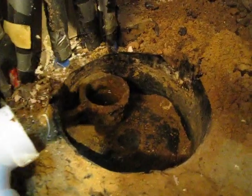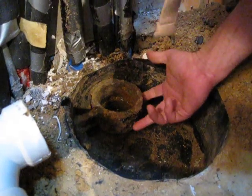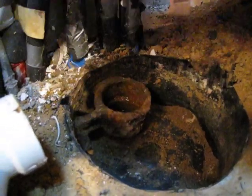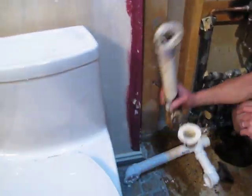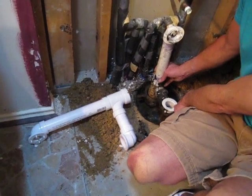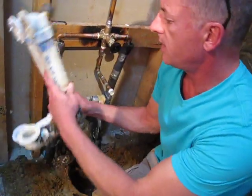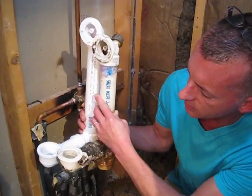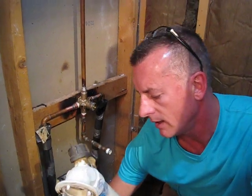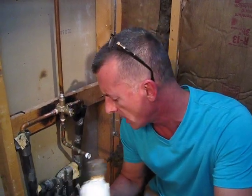Let's climb down here to the hole — this is really the nature of why I wanted to do the video. This house is actually a cement foundation home and we have this wastewater piece coming up. The way this works is that this piece goes down inside here — this is the overflow for the tub, this is the drain for the tub. When I set the new tub in place they didn't line up anymore, so I had to create this new piece. You can see the dimensions are a little different — it's a little longer in both dimensions than the old one, so there's really no way to get a good frame of reference for measurements. You kind of have to fit it together and piece it and fool with it a little bit, and that's why I had to go in and out with the tub until I got it to line up.